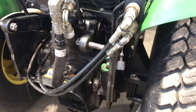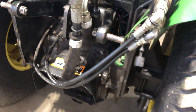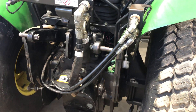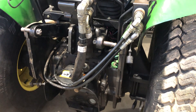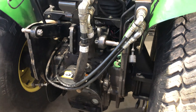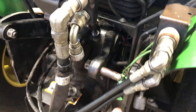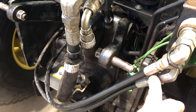Lots of times I'll see machines where the two hoses that connect in here are just hanging in the back and disconnected. You really don't need to disconnect these hoses because they're really just there to run the up and down, and there's a separate valve so they're not really active unless you run the valve up or down. They go either way.